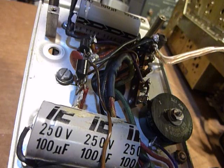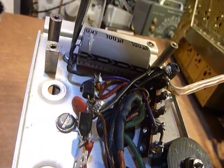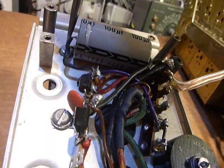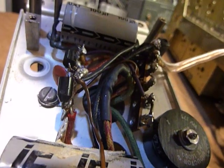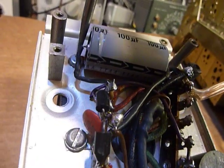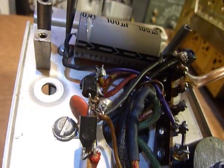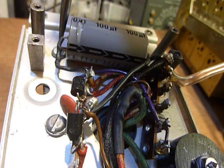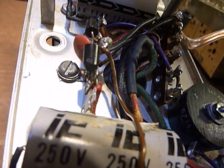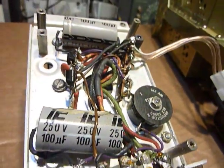I have to say I'm the guy that put it in there. I found out that it does not have a nut on the other side. The power transformer has threaded feet on it and I screwed that right into the threaded feet. What I found out was that it was very loose in those threaded feet and I didn't realize it — it's been in there all that time since I built the power supply in '72. I put a bigger screw in there, re-tapped that hole with an 8-32 tap and put an 8-32 screw in. It's tight now and it won't come out again.